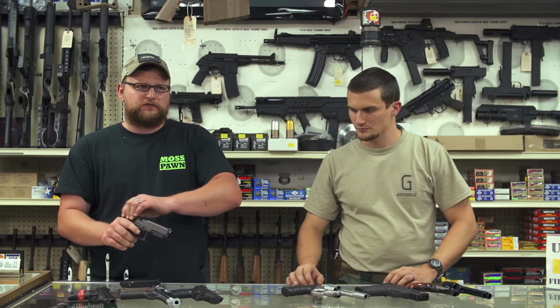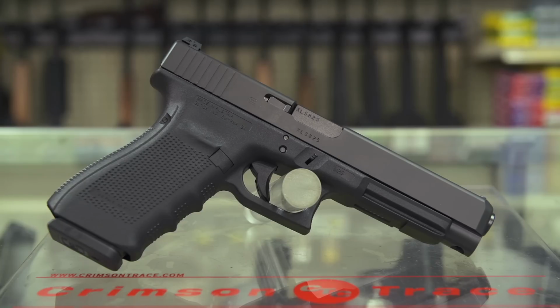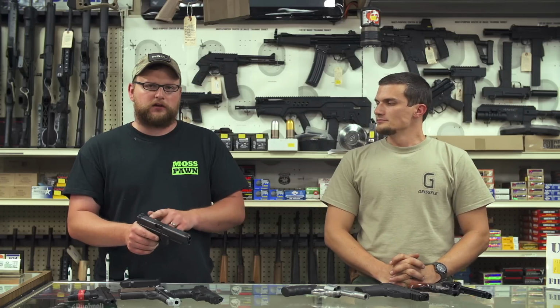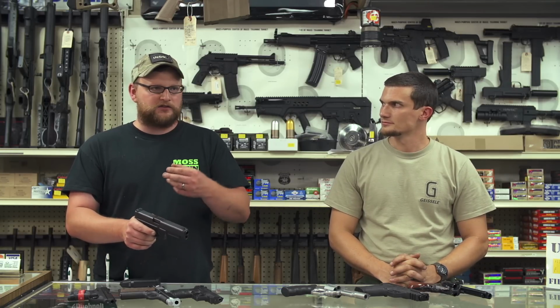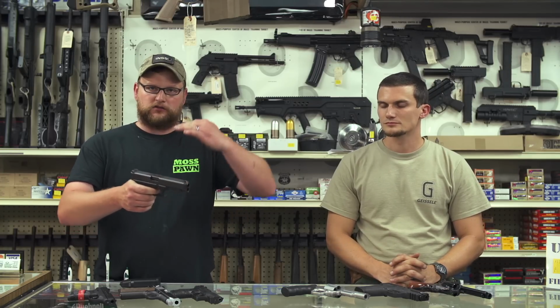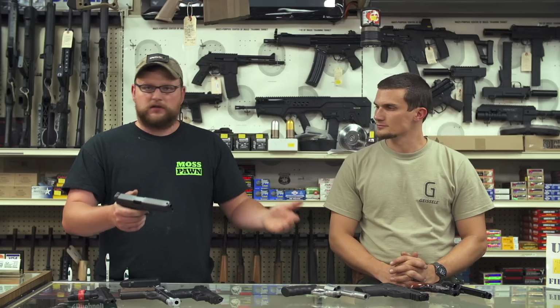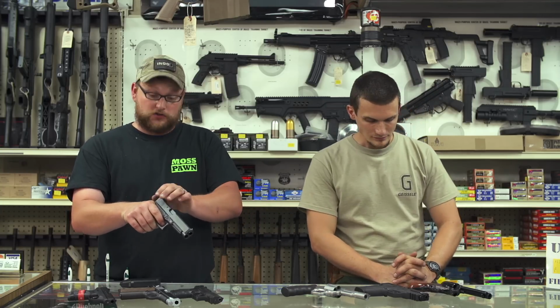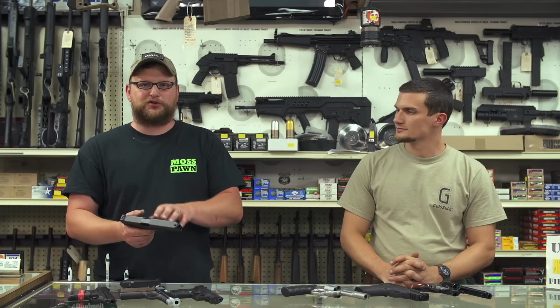So we wanted this video to be kind of fun and entertaining, but we also want to show you some new guns. All right, here at Moss, we just got in a bunch of these 41 Gen 4s. It's the new long slide .45. Now, as many of you know, a Glock is a striker-fired pistol, which means that it has an internal striker system, no external hammer of any type. A cylindrical striker rides within a slot cut into the slide. The trigger pulls back and releases the striker mechanism. It pulls back and then lets go at a certain point, and it allows that striker to strike the firing pin and fire the pistol. It allows the gun to stay very streamlined and low profile, but part of the disassembly process for a Glock pistol is to dry fire it.